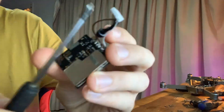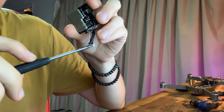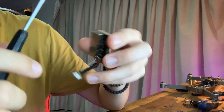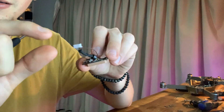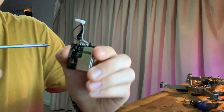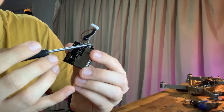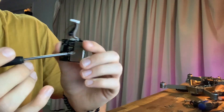So I took the wire out of the actual unit. I had to unsolder it from the board — it was a bit tricky because it's quite small. I just got some old telephone wire or Ethernet cable wire, cut a little short piece about the right size. I re-soldered that wire back onto the board and ran it straight back down to the unit. There was also a white wire that looked a little discolored, so I replaced that one as well — two wires replaced in total.